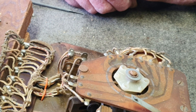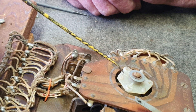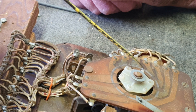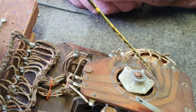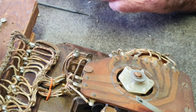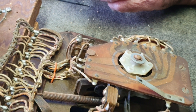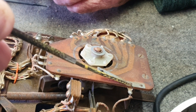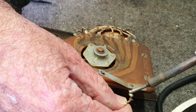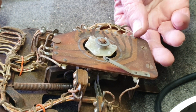We're going to unscrew the three screws and take the score reel out. We've removed that plate and there are the studs — the larger one and the two smaller ones. You may also notice there's an arrow pointing to the zero position. The next thing to do — and this really makes life easier — is to unsolder this wire from the board so you can move the board out of position. Then undo these two screws.